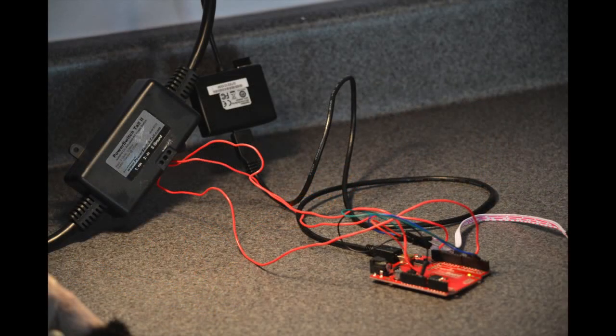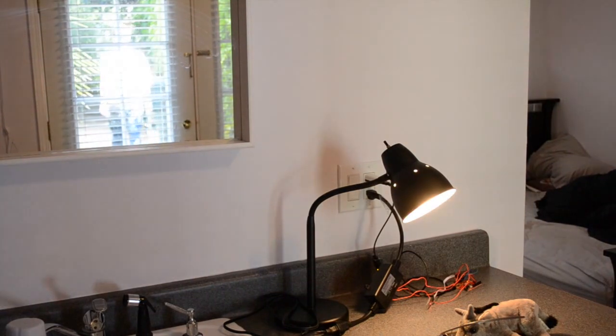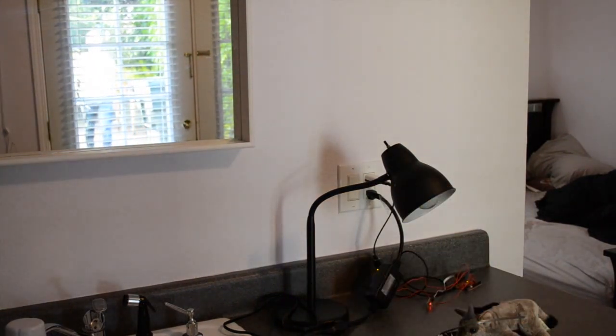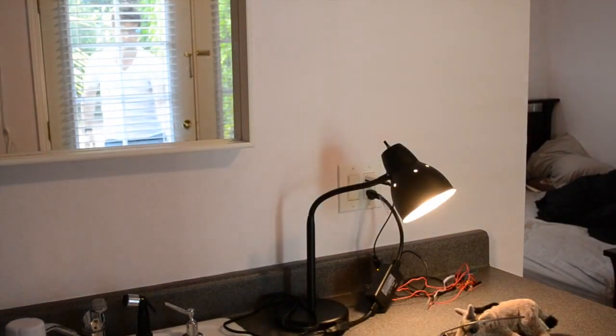An inexpensive way for the system to know what room you are in is with Bluetooth beacons. Here I can control a light based on if I'm in the house or not. This works slightly differently than motion sensors in that you can be still for periods of time without the lights turning off, and can customize the room based on who is in it.